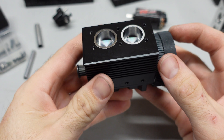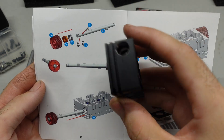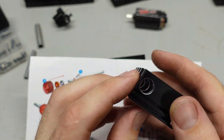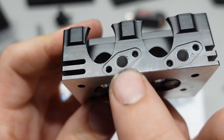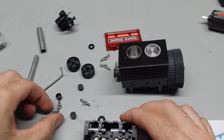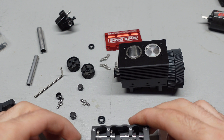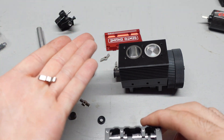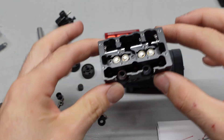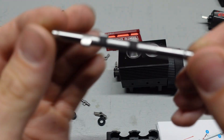Now we're going to focus on the cylinder head. It looks like a dual overhead cam in the picture but it's actually just a single cam. You can see the two holes for the glow plugs, the exhaust ports, and the intake ports. We're going to install the camshaft, put the buckets on top of the valves, install the little rocker arms, and once all that's done the whole head will be assembled and we can slap it on the block.